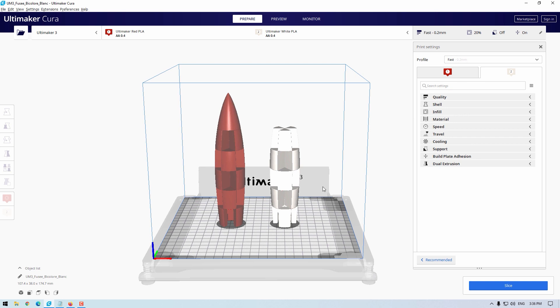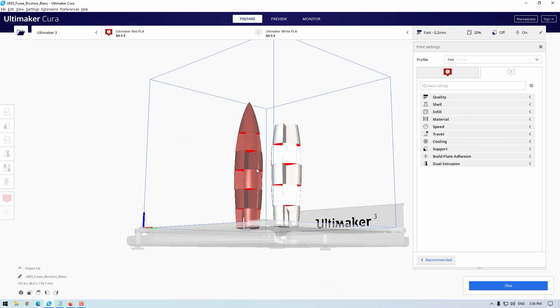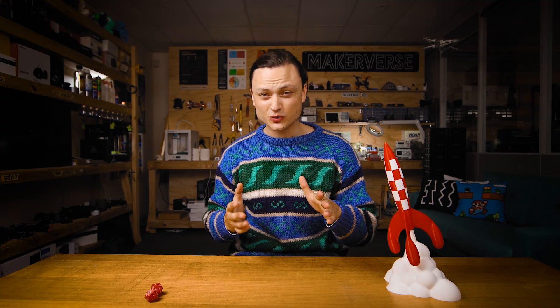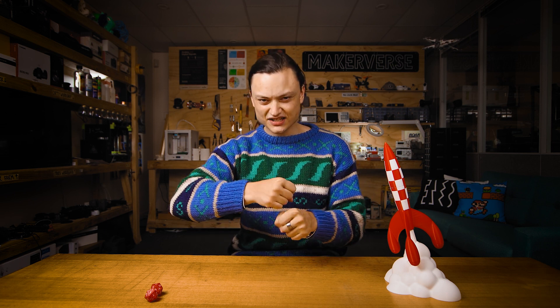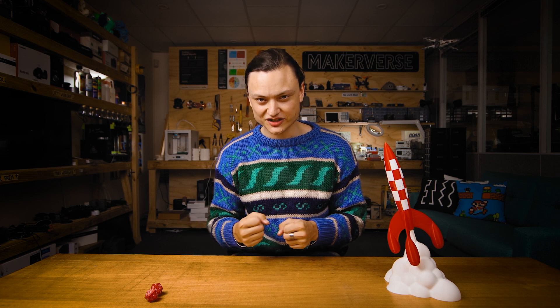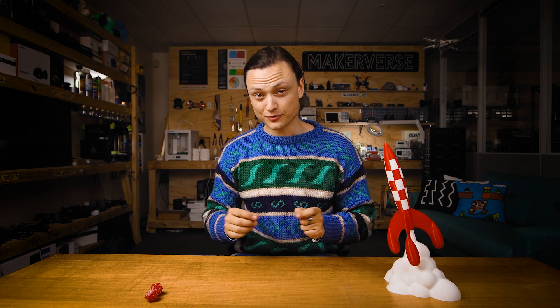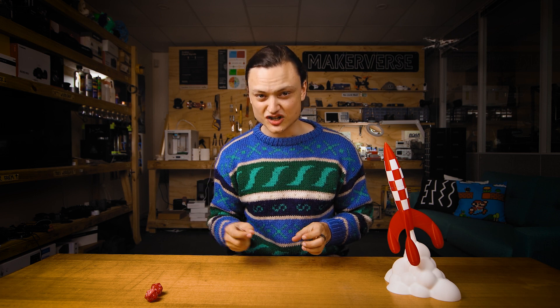On the screen now you can see two models which represent the red part and the white part of the rocket from the Adventures of Tintin. To increase the crispness between the colour transitions, have a small relief or trench between colour sections on the surface when looking at the X or Y plane. In the Z plane, ensure that there's no gap between the colours and make sure that they don't overlap unless you want to start mixing the colours together. This trench is less than a millimetre thick and is kind of imperceptible from a distance but it does make a huge difference. In a close-up of this rocket you can see that tapered trench visible between the sections — so click that chamfer button in your CAD designer.